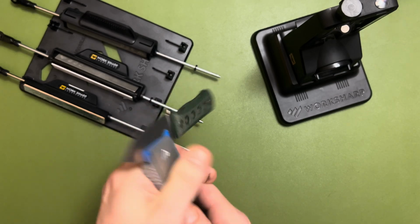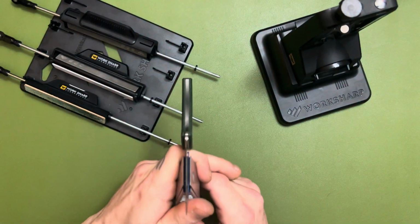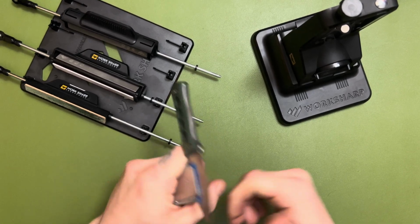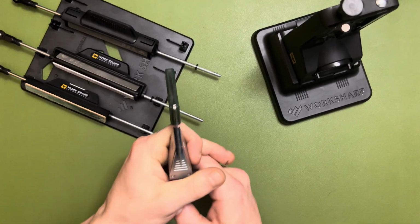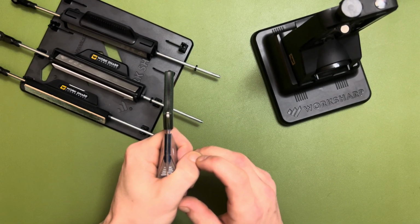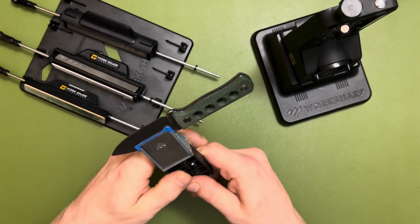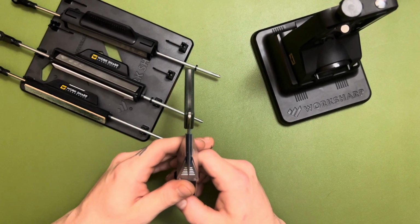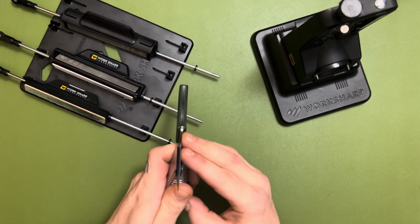You really want to make sure you got this right, because if you put it in wrong, your angle is going to be wrong. You're going to hit one side more than the other, and you're not going to be happy with the performance of your machine. Okay. So when you tighten it, also make sure that the blade hasn't moved because it will slightly. And then just put it back into place. Okay. And these, it's a shame. These are a little hard to get tight, but if they could have made them bigger, it'd make it easier, but it is what it is. Okay, so like I said, make sure you got the blade at a 90, straight angle.